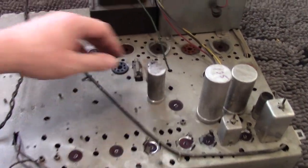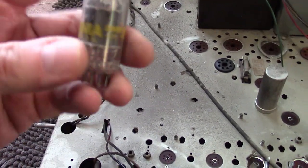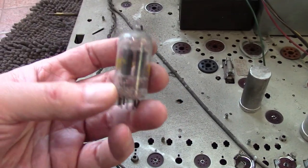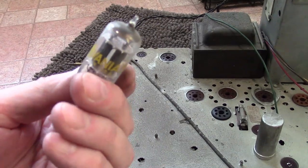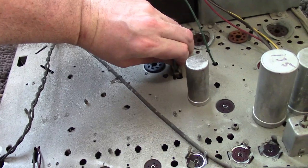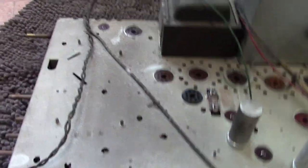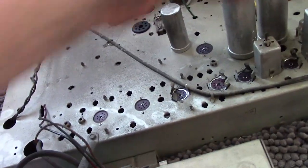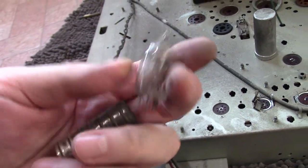Of course, I'll pluck out all the tubes and put them into my bin of used tubes. A 12AU7 — definitely, if this is still good I would definitely want to hang on to that. Good Sylvania, made in the USA. Fuse — sure, why not. Fuse holder, maybe if it's screwed in, but it may be riveted in, in which case I wouldn't bother. Tube shields — yep. Probably a 6AL5 hiding down in there for the sound.